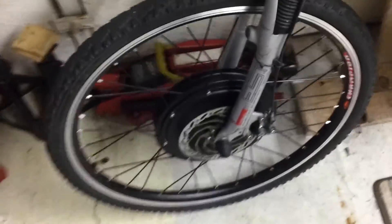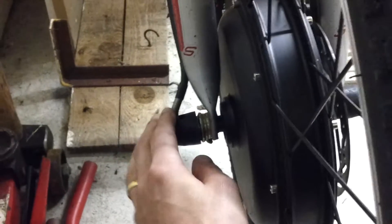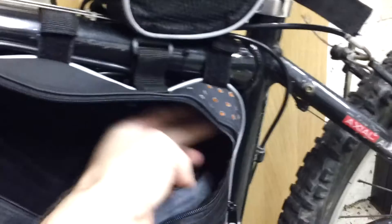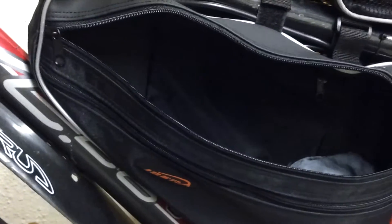There's still some fine tuning I've got to do. I'm beginning chapter two now — this is the shakedown chapter, finding all the faults, making sure it can last, all that kind of thing. Among the many things I need to do is put some bathroom silicone sealant style stuff under this little protective cap and really try to seal this area from water and grass. Any water that catches this wire will simply run down it due to gravity and straight in there. I also need to protect the battery inside this space a lot better. I put it in without padding earlier and it kept hitting and banging the back of the tube on the bike as I was riding — that's not good. I need to make it a lot softer for the battery.